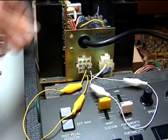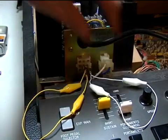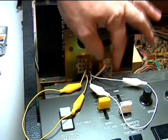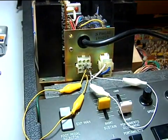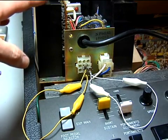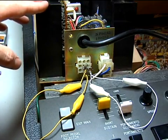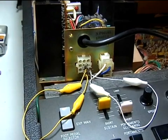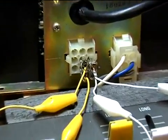Place the power supply loosely back into the CS80 chassis and connect your AC power switch, which is this Molex connector — actually, it's the wiring that goes to the AC power switch. Do not attempt to power up the power supply at this time because you will damage it without hooking up these two jumper leads. We'll zoom in closer.